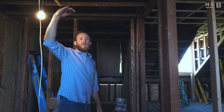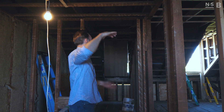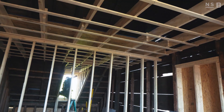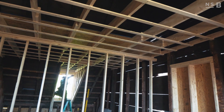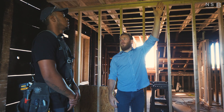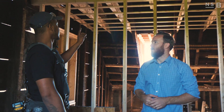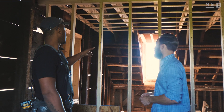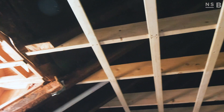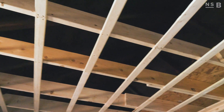Above me you see the existing ceiling height. We met with the client and chose to leave this ceiling height as is, but as we enter these two larger bedrooms, we actually decided to push the ceiling up. So Lasana, what determined our ceiling height in here? All the dormers were original except for this one — this one was remodeled at some point, probably due to water damage. So that was our low point, and then we carried it across the whole ceiling.